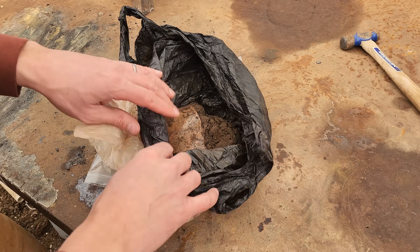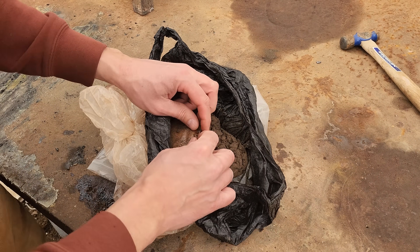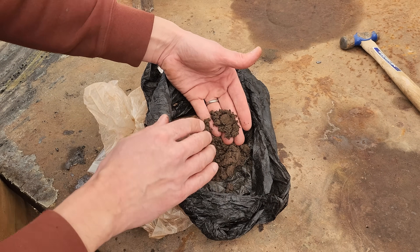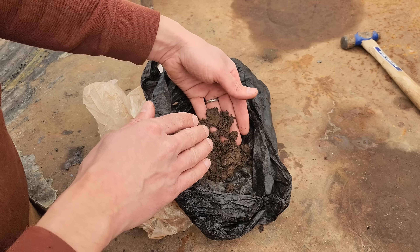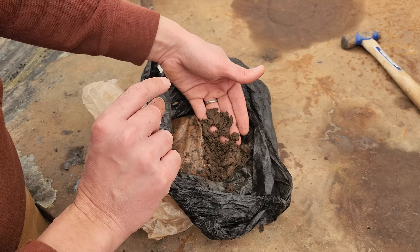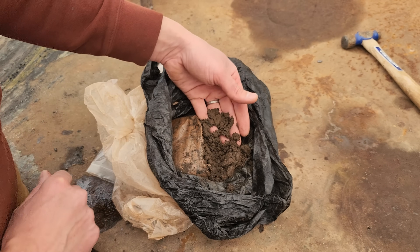Here's what we're going to be working with today, and this is a little bit of a special sample. This came out of Ghana. A friend from Ghana sent it to me, and they were having some difficulty with the matte layer in this. The matte layer is the sulfides that form during the smelt, and if you don't get your mix quite right, you'll have this layer between the metal on the bottom, a matte layer, and then the slag will be on top.